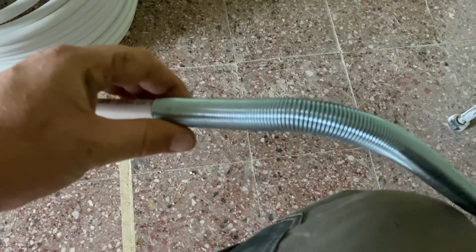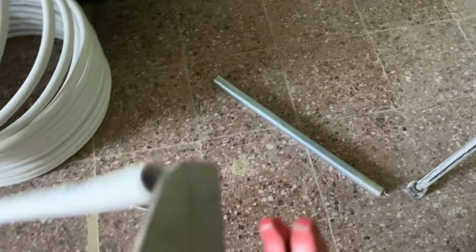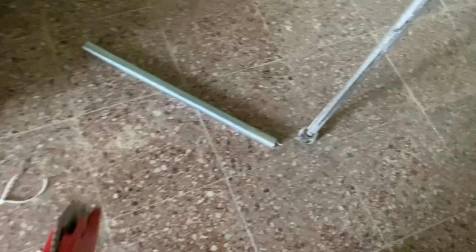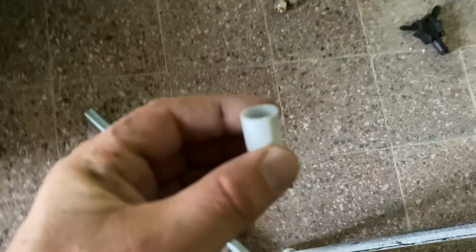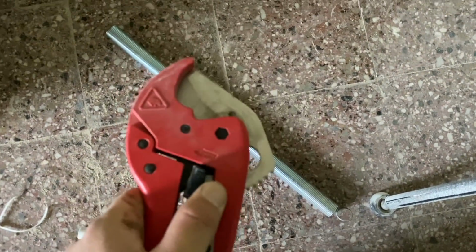So you have three main tools. This spring fits over the outside of the pipe like that. And when you make a bend, it stops the pipe from collapsing or folding, so that it keeps it nice and rounded throughout the bend. Then you have a little ratchet driven cutter, so that basically you just chop very cleanly. It's a pain, I can't focus properly on this, and squares off, and you don't want to get your finger in there because there's not much that will stop this.